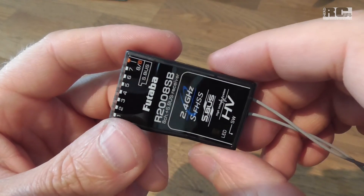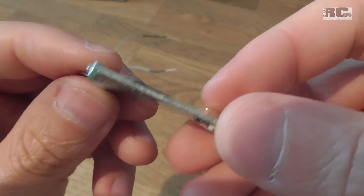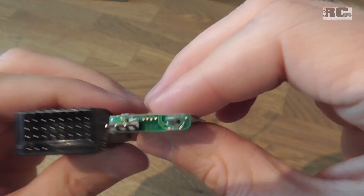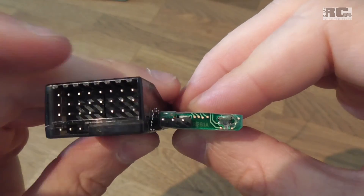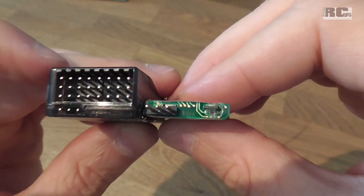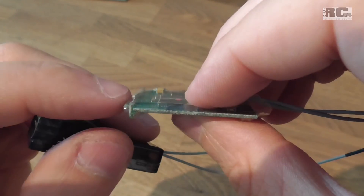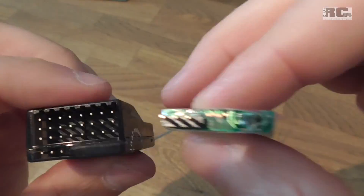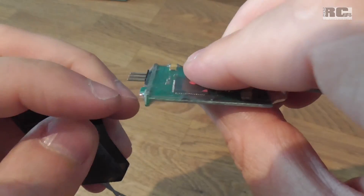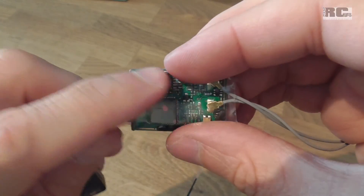What I tried to do is modify the receiver to make it smaller and also more lightweight. What came out is this one — it's the same electronics, but I took off all the connectors used for traditional wiring. The modification is pretty simple: just take off the case and cut down the electronics plate where all the traditional wiring connectors are sitting. You have to be really careful when cutting not to hit any parts on the bottom electronics plate.